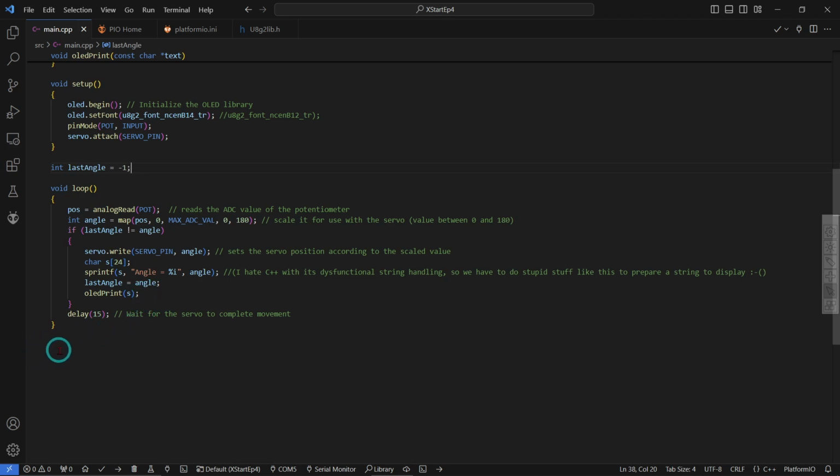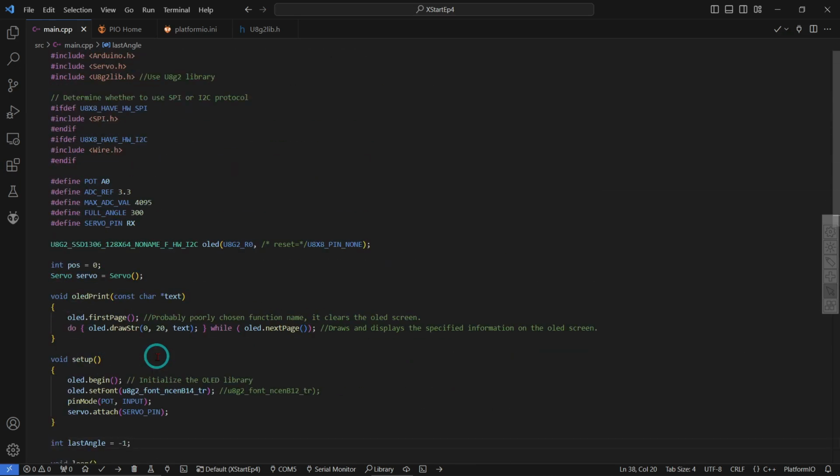Anyway, and then we have a delay of 15 milliseconds, I should say, because if you were going straight from 0 to 180, it can take a little bit of time for the servo to complete its spinning around. And that's it. It's as simple as that. So, as I said, it's going to be a short episode here.